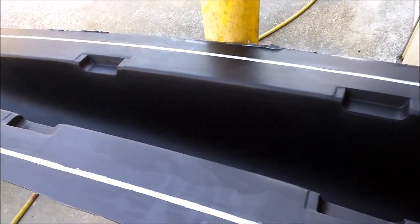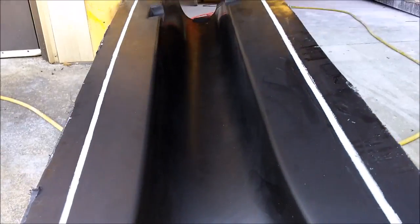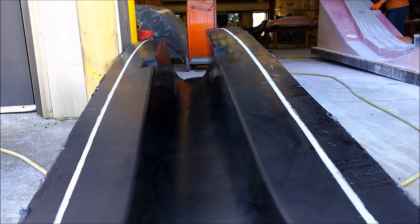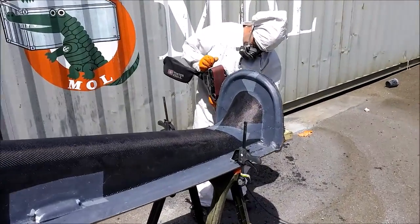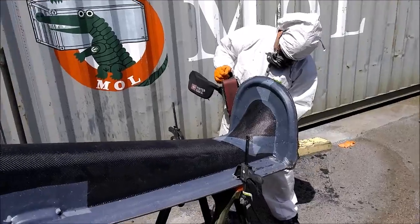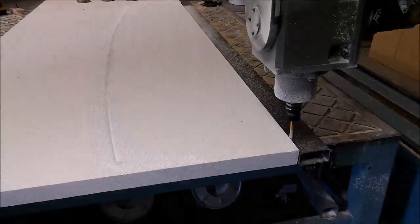The next thing was to finish trimming the edges, straighten them up, and take the wax profile out. That all got done yesterday, so it now just needs the bracing — which you'll see shortly — and it'll be ready to lay up the keel. Here it is off the plug, cleaning up the edges more, sanding to a straight line, just making it look good.